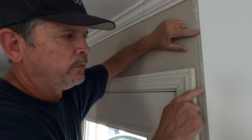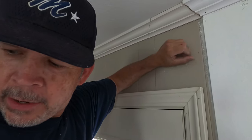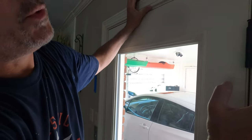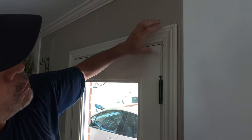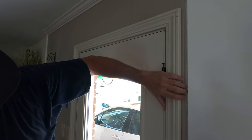To finish off the raw edge of this drywall we use what's called L bead or L mold. It looks just like the corner bead we put on the pony wall, but one leg is short. You can see how nice that finished it off. We kind of struggled with where to make this transition — we needed it towards the door but didn't want to reframe or re-case the door. We did it right there on top of a king stud, so it worked out great.